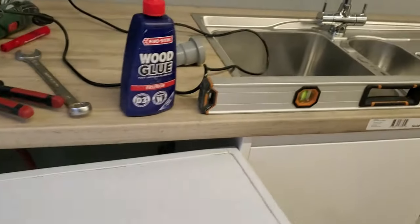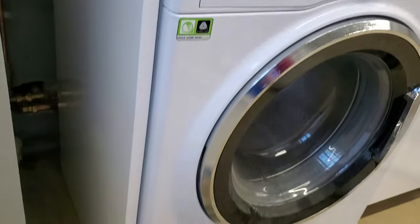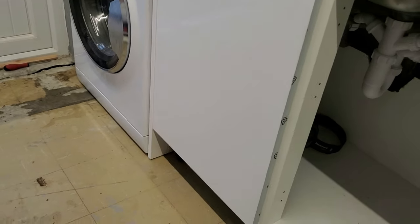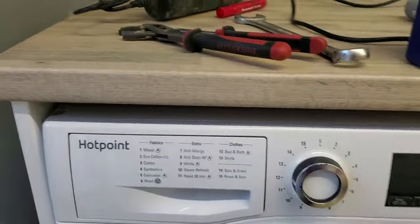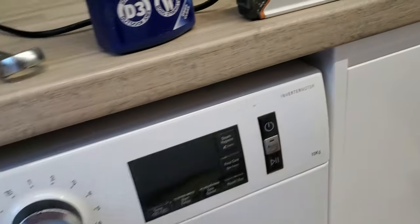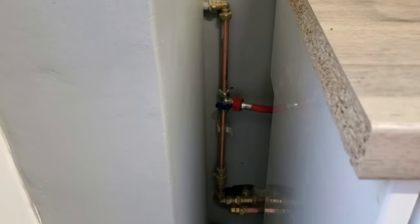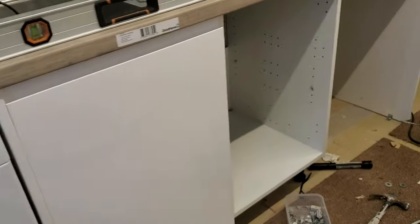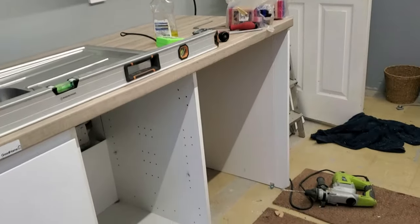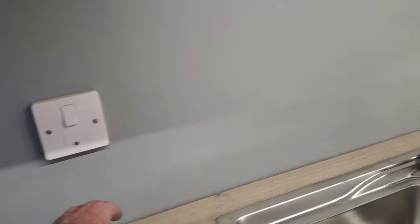That's more likely how your house is going to flood - not because a pipe's going to come off a sink, it's kind of like a kinked end pipe. The washing machine is in now - you can see half a centimeter gap, you'd barely see it, and the glass panels all around. I think that's pretty neat. It's not rocking - it's just dead level. She always rocked a bit on the old floor. Water's turned on. I adjusted the angle of that fitting a wee bit. I'm going to pull one of these doors off, get the dishwasher on, then get the backboard on. I'm not going to glue this on - I'm going to use silicone to hold it.